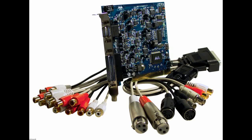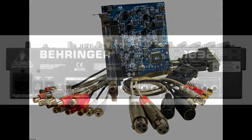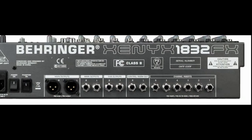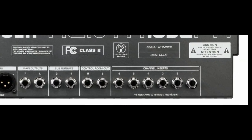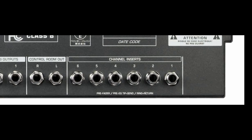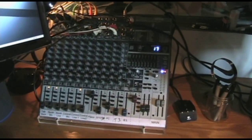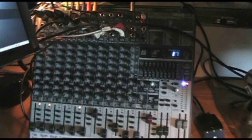So that's the equipment — now let's look at how to set it all up. There are more than a few ways to do this, but I'll show you exactly how I do it here. Notice on the back of my mixer the first six strips or channels have their own channel inserts. I used the first six audio inputs from my M-Audio Delta 1010 to go into these channel inserts. Most mixing boards will have this capability and the functions will be similar.